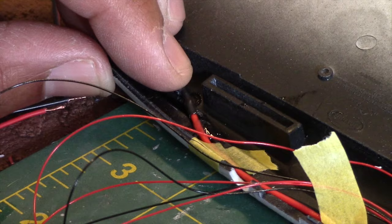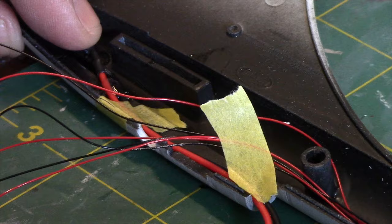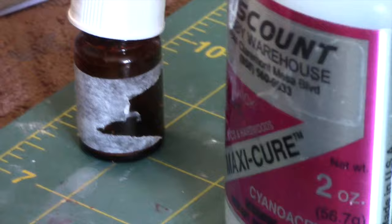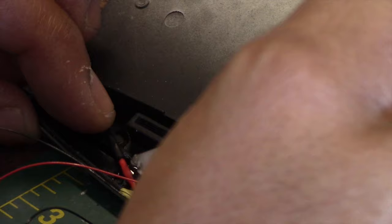Just to show you how I am securing the lights into place — I'm using super glue versus hot glue because hot glue is not good for the wires and it could damage your LEDs. I use super glue with an accelerator. Here we have the 5mm flickering LED into place. I use masking tape to hold it in position and simply apply the super glue, then put some accelerator, and that way it hardens the super glue fairly quickly so it stays in place. Once that's done I just give it a minute to make sure it's dry and then peel away the masking tape.